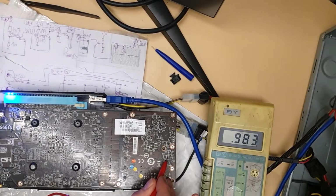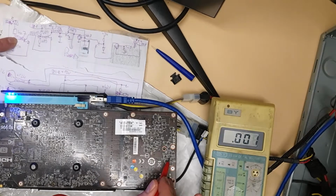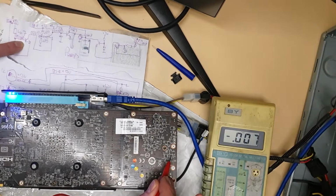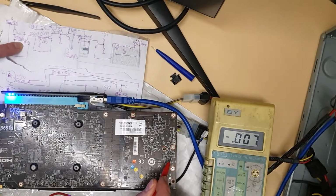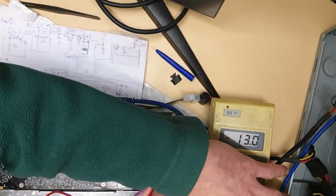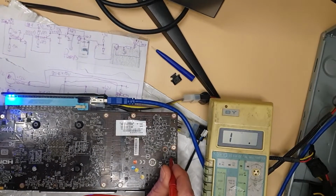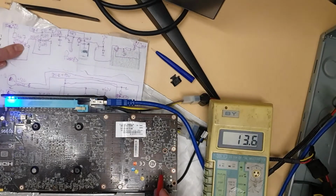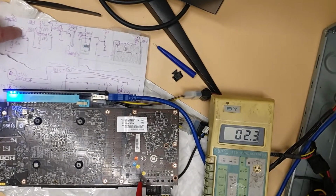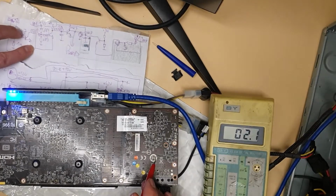And you can see we got this first divider here, and we got 0.9, almost 1 volt here, and that's the same on the base of the transistor. Power sense ground. We can basically go to continuity mode. Be careful, so turn it off then. Normally we will have here like 0.67, 0.6, 0.7, which is the voltage on the base emitter if it is on. But if you got 0.9, it's suspicious straight away.